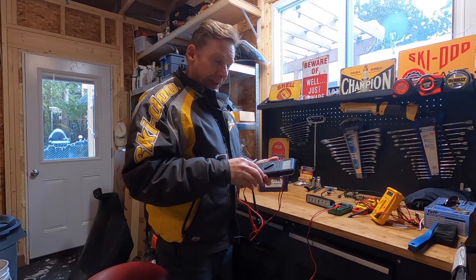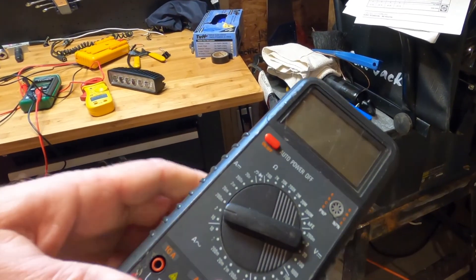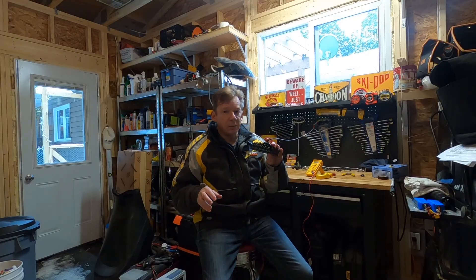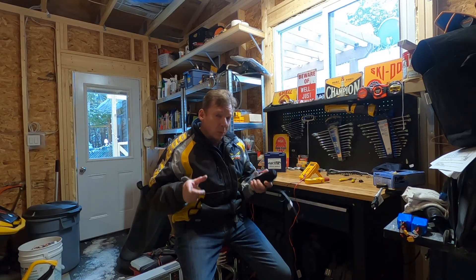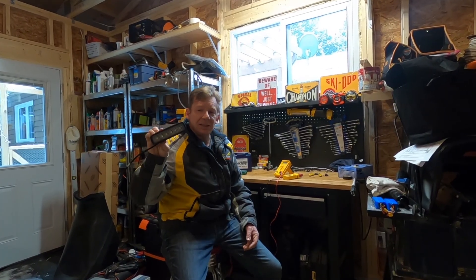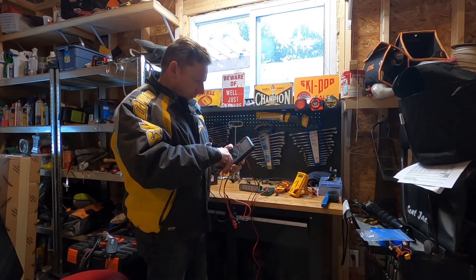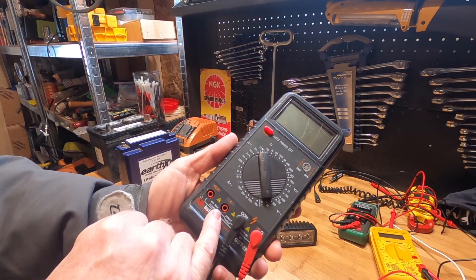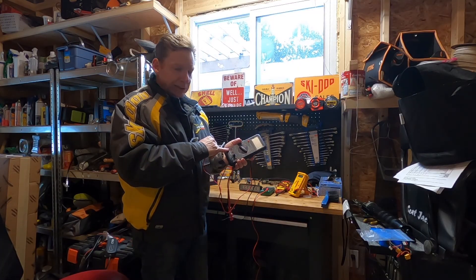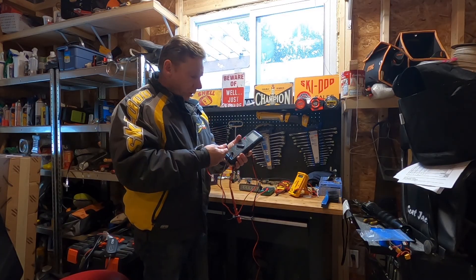To switch the multimeter to amps, that's just a capital A — in this case, DC. This is probably going to draw an amp or two, so I'm going to set it to 2. It's always best if you have some idea how much something should draw. You can check the manufacturer's website, or use Ohm's law, which tells us that the current flowing through a device is proportional to the voltage. I know this is an 18-watt light: 18 watts divided by 12.5 volts gives about 1.44 amps. Also, move the leads — I'm going to plug into amps. A lot of multimeters have two different amp jacks: one fused for 2 amps max, and one for 10 amps max. If you're not sure, put it on 10 amps.